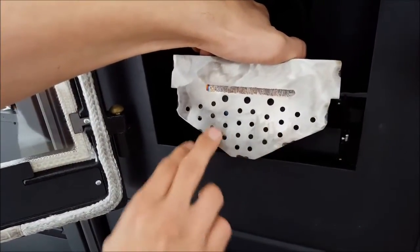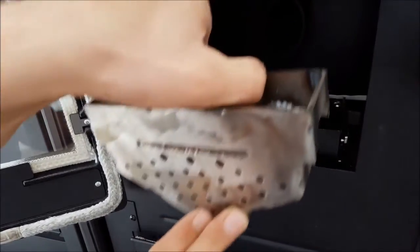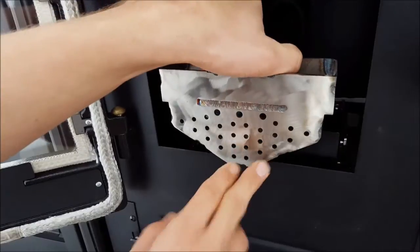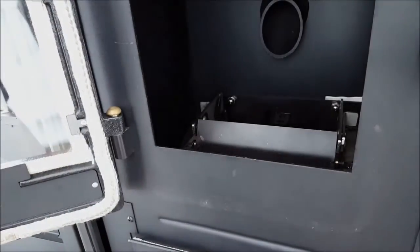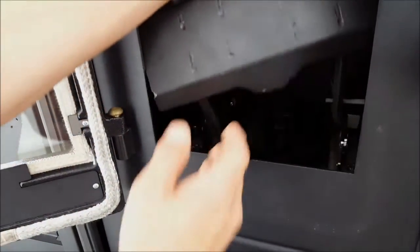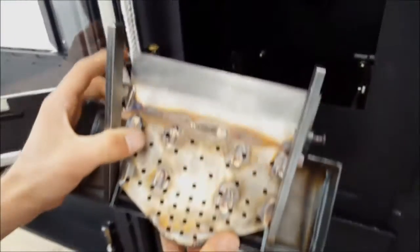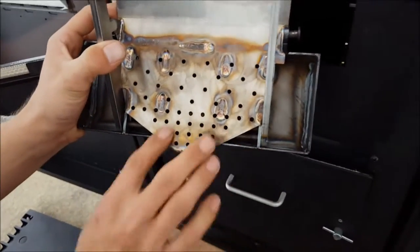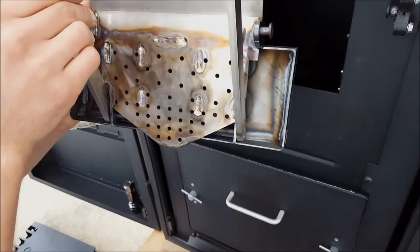With a pusher assembly, you want to keep in mind this lower section is going to get the most debris buildup, as this is pushing forward and a lot of the debris actually gets packed in those bottom ports. Same thing with the back side — the lower section is going to be commonly packed full of ash, as this also gets some of that ash being pushed up against it.